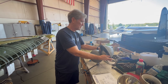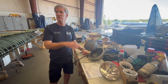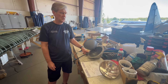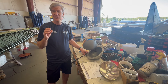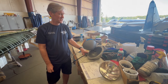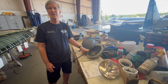So tell us about the testing of the light — how'd you test it? How'd you determine the motor was good? So we have a test station at our electrical bench. We hooked up the 28-volt supply. At first it didn't work, and we had to trace down a couple of issues — mostly these little contacts that just had white powder on them from years of either use or sitting in the West Texas desert or whatever. Once we cleaned everything up, it worked fine, which was helpful. We didn't have to go out and get extra parts.